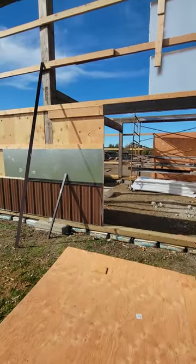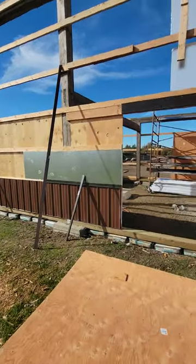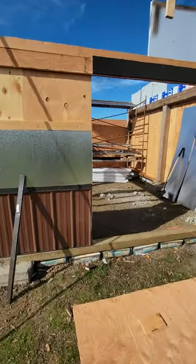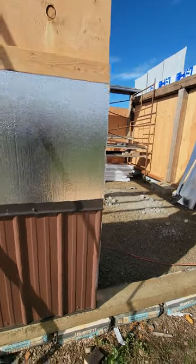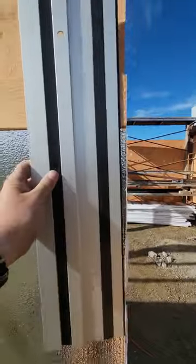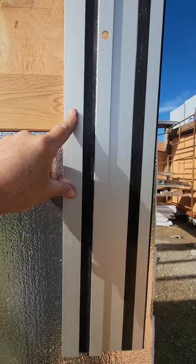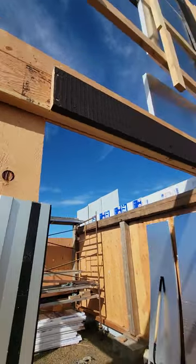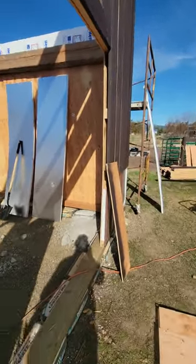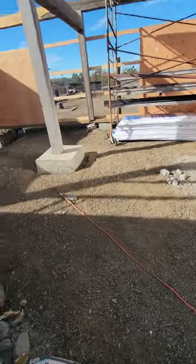When I put up all my plywood sheeting across this door — it was just one big wall of plywood — I took my 96-inch-plus track, set it up against the wall, leveled it out, had a second person hold it on the edge, and ran the track saw from the bottom straight to the top. Then did the same going across the top. We only had to cut out the little corners with an oscillating tool, which was a really nice way to get that done.